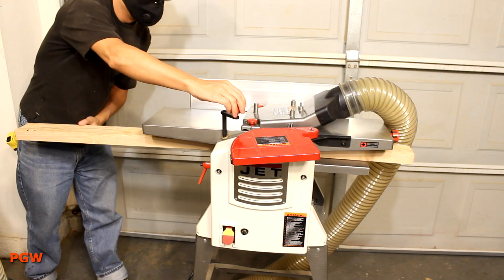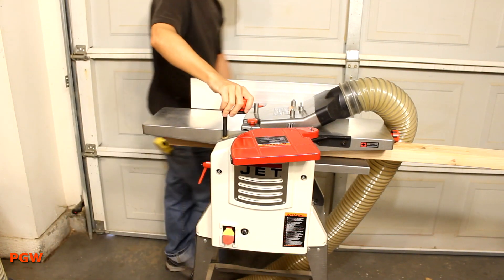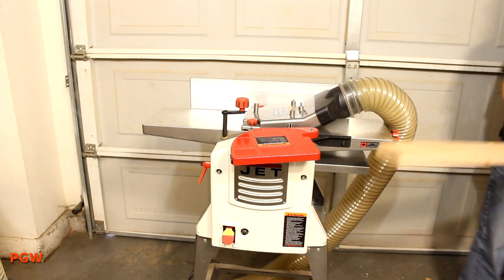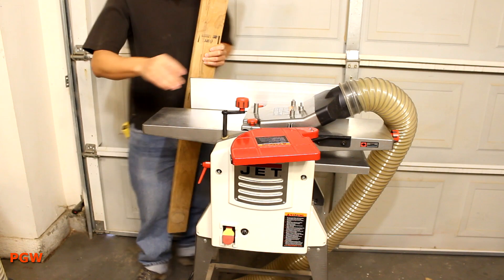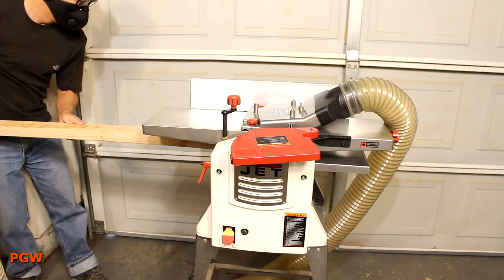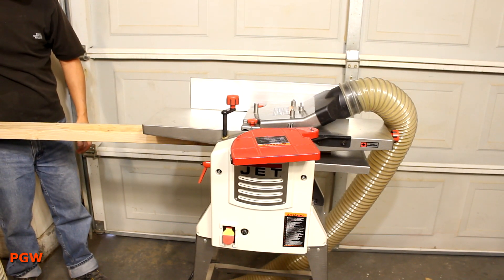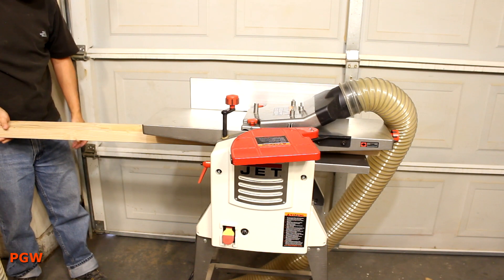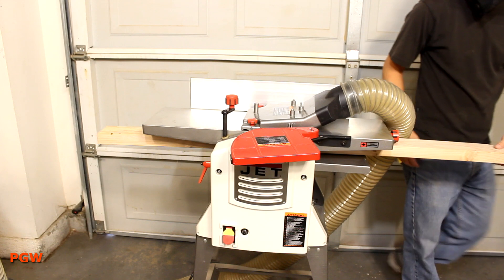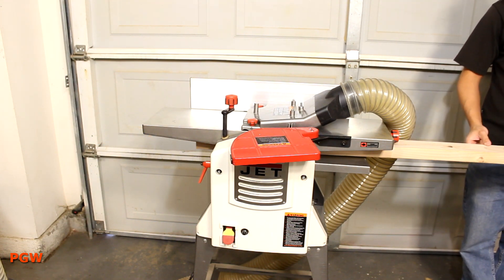For my first pass I tried to set it at an inch and a half with the little arrow gauge that indicates the height of the cutters. I think it actually indicates the height of the rollers, because halfway through the cut I had to wind it down just so the cutters would engage the material. Unfortunately there's only one speed for the planer, so putting this 2x4 through there it's really making that motor work. This is only a 1/16th of an inch I'm planing off.